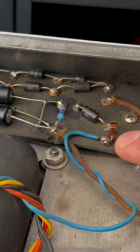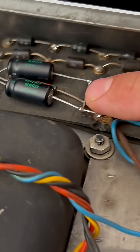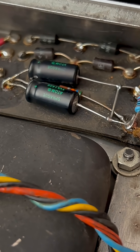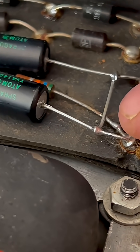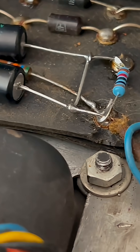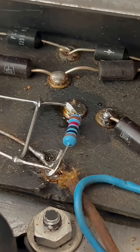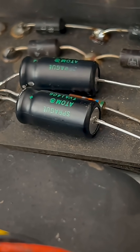Was this additional resistor placed here because the raw voltage is a little too high? I'm not certain. But you can see here that he took this 10k resistor out of the equation by jumping it with a bit of bus wire or a snipped lead. He essentially put these two filtration stages right in parallel for one. We're probably gonna undo that and go back to the older school method.